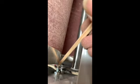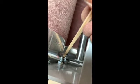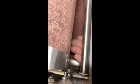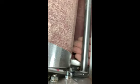I do want to point out that right here, I don't know how well you can see that, but I'll see if I can raise the roller so that you can see it. I have milled a tab out of that corner, about, I'd say, 1/8 of an inch. And partly because my bracket is wider, so I needed at that point to more closely approximate the original, but mine is still wider at that point to keep this bar up a little bit further when nothing is happening.